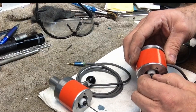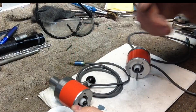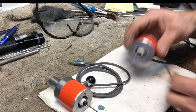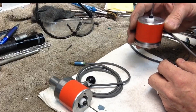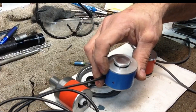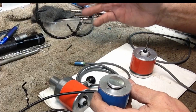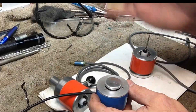I'll unscrew this probe tip, set it aside, and build a little brass cup for that — it's standard turning, same kind of setup, so I'm not going to videotape that. What I am going to build for it is a little mount that will hook into a T-slot on the mill table so I can set it on the end of the table, bolt it down into a T-slot at a consistent height — both to probe tool lengths and, during a program run, to check for tool breakage by programming it to move over and touch off.